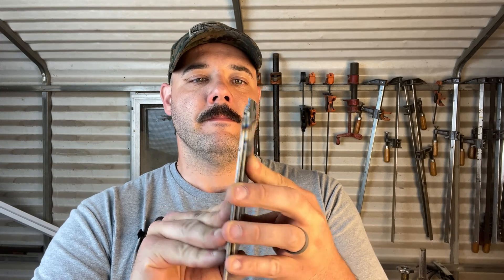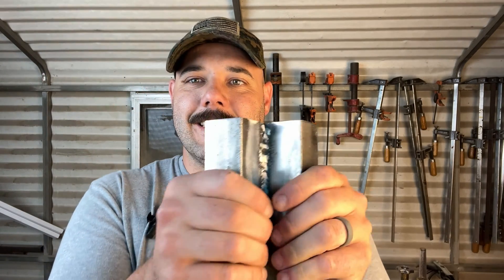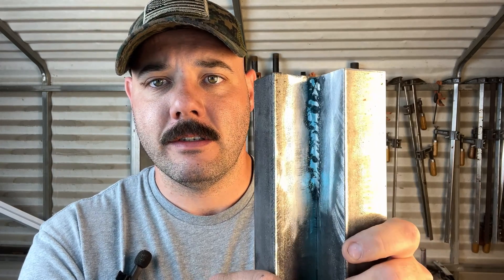I've tried to break this thing apart, tried to split it. I know I can if I have enough force, but I'm using it for repairs — I'm not trying to really break what I'm repairing. Last but not least, the valley. I'm not the best MIG welder in the world, but I don't see any daylight where the welds are. It's nice and solid. I can't break it, I can't bend it, I can't do anything. Overall, for 110 volts, it's not bad. And it didn't throw a lot of slag everywhere, which was kind of crazy. I'm so used to working with the Harbor Freight variety of flux core welders where everything gets covered in slag.